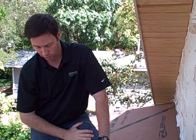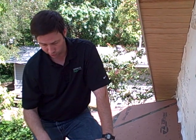And then it gives me a second layer of protection. On this particular house, we're doing an inch and a half of ISO board, which is a rigid foam insulation, on top of this roof. So we'll attach that first, then we'll come on with our tar paper, and then we'll attach our standing seam metal roof on top of that.